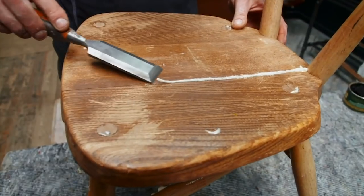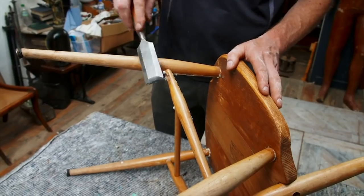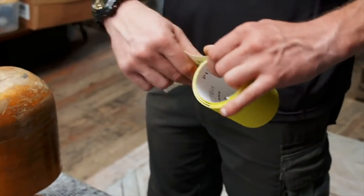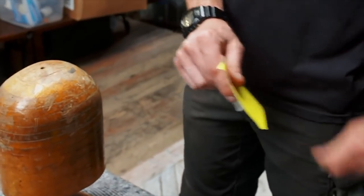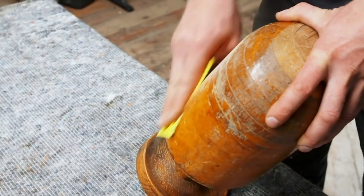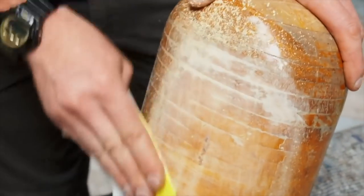When cleaning off the glue, just be gentle that you don't scratch the surface of the chair. Although we're going to be re-polishing it, it doesn't mean we need to put a gouge in it by being careless. The first thing we're going to do is give this a good sanding to get it nice and clean and smooth. We're going to start with a 120-grit paper — the number's always written on the back of your sandpaper. It's important to start with a coarse grade and then go down through the grades to get it smoother and smoother, which is enough to key off this varnish.